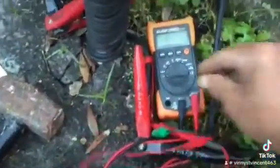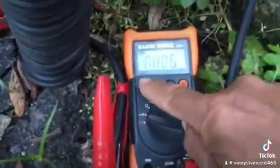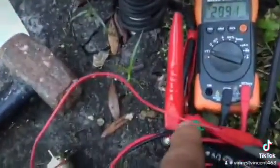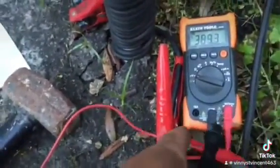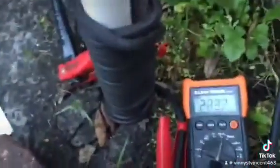Okay, so over here, we're going to come over here. We are going to turn on the voltmeter. Bada bing. We're going to put it on DC. Now, I got one end of the voltmeter, guys, just inside the out part of the primary. Okay, and look at the voltmeter.